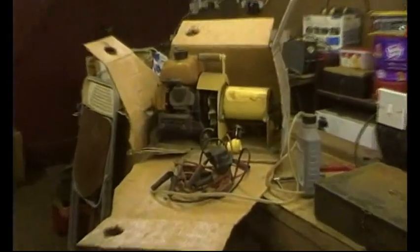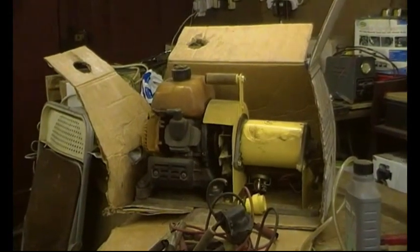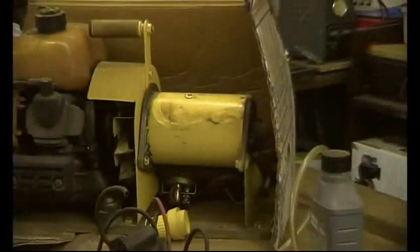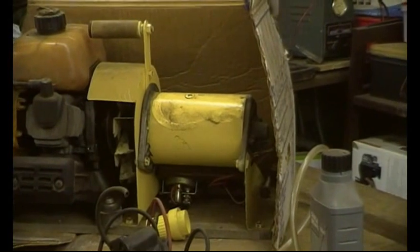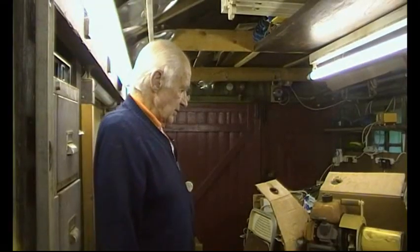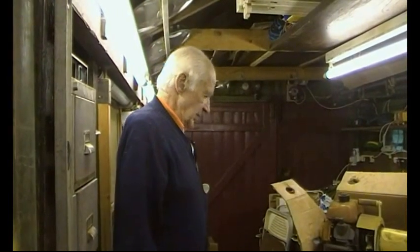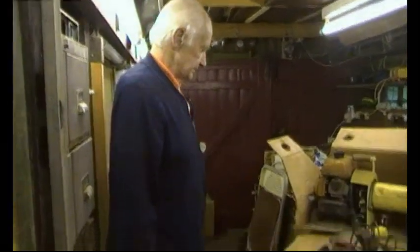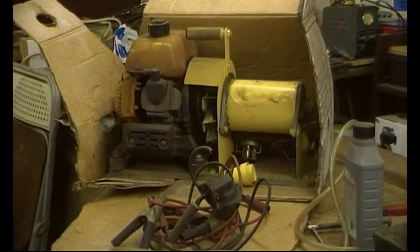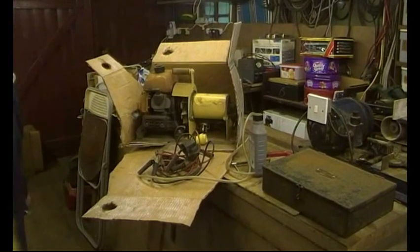We've got an extra item here. This is something that Harold made a few years ago — he obviously picked up a little foot-mounted two-stroke engine and did a direct drive connection to a Lucas alternator, a Lucas dynamo. Because it doesn't have any windows it could be a tractor dynamo. Why did you use this Harold? Well, the idea was if you were stuck on site without electrics, you could charge your battery up with this. Nowadays all sites have electrics so you don't need it. A little two-stroke engine like that at about 1,500 revs would drive that 12-volt dynamo. And it's been sat in this box for 20 years.